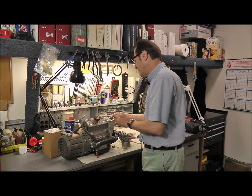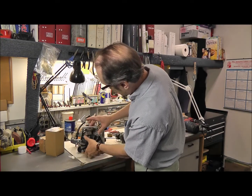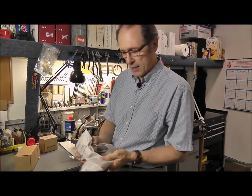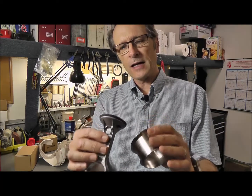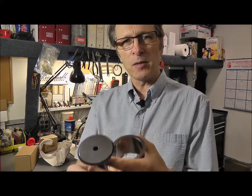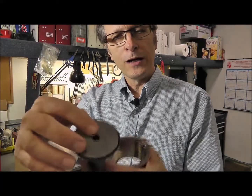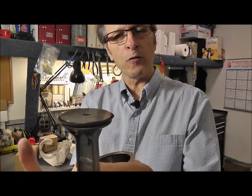This particular kit — you're going to notice you have that piston that goes up and down in kind of a wobble-type motion. I'm going to show you the piston cylinder kit that you're going to end up getting. The piston cylinder assembly comes as a kit, and the piston ring right here is already pre-assembled on this one. On some units, you can actually buy the piston ring and the cylinder separately. What you simply do is remove the screw, take the flat ring, and when you tighten the top down, it's actually going to make it concave, turning the flat ring into a concave one.